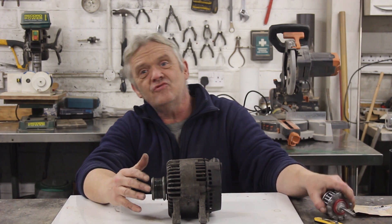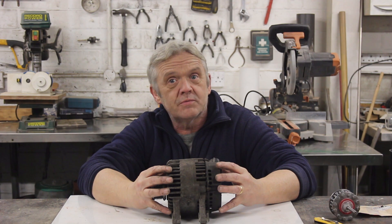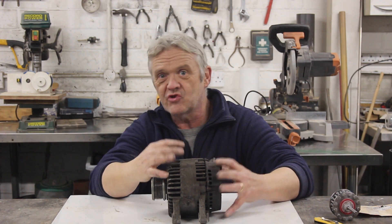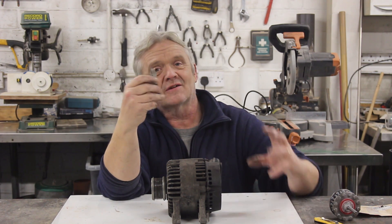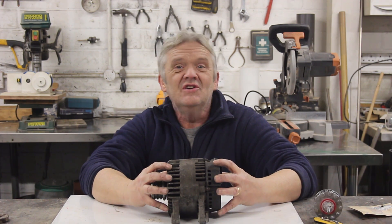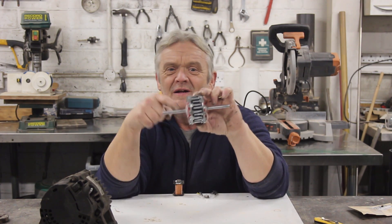This is a car alternator. It does exactly the same thing, only with a coil making the magnet instead of a magnet making the magnets. And if you want to, you can turn this into a brushless permanent DC motor — you see people doing it by drilling into the crab claw alternator, but you don't have to. You can take that alternator apart and put one of these in — a neodymium ring magnet — and then put the alternator claws back together. Exactly the same thing will happen, and you will find you have a generator. So if you want to bother doing something like that, you'd have a good generator; the way it works is it bends the field round from here to here.